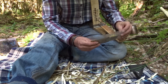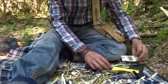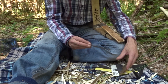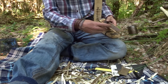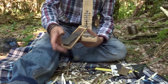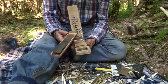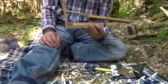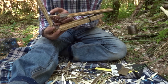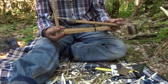I'm using my jig. I've got a whole range of sandpapers and wet and dry with this particular knife. I'm just going to give it an extra little bit of edge with a bit of 1200. The measured angle on that is about 16, 17 degrees. I know that from measuring it before and it's got it written here. And that side is actually more like 19 degrees, so there's quite a bit of difference between flipping it.